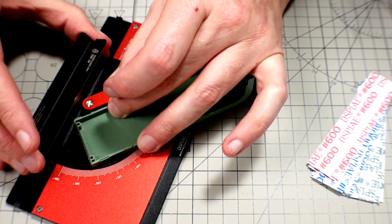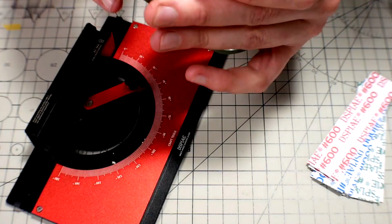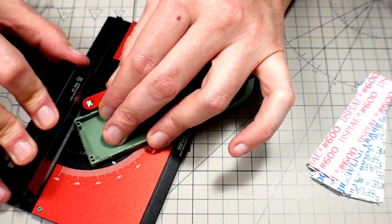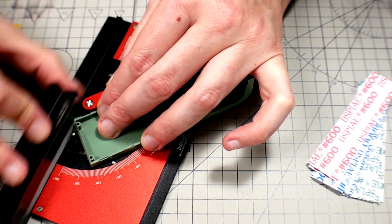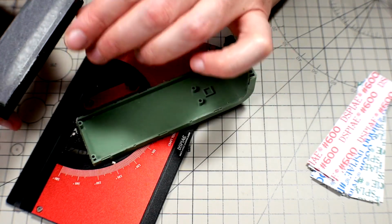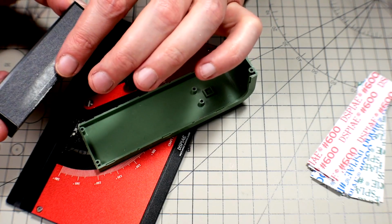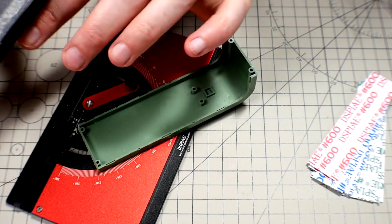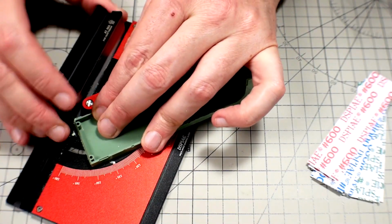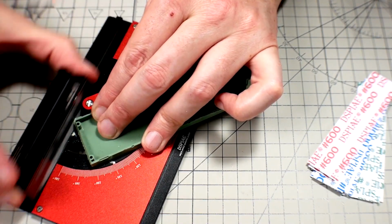And it actually works okay. You just want to slowly slide it, and I'm doing it at an inappropriate angle. But as you sand it, I would recommend putting some downward pressure on here. And then of course you could have a higher grit on the other side. If you really wanted to go for it, you could actually cut these down the middle. You could have, say, 600, 800, 1,000, 1,500 on each side, so that you could literally do this and then flip over and do the other side and then continue with that.